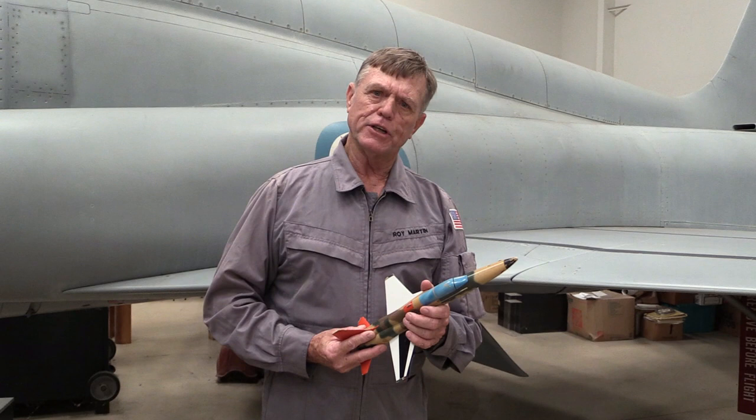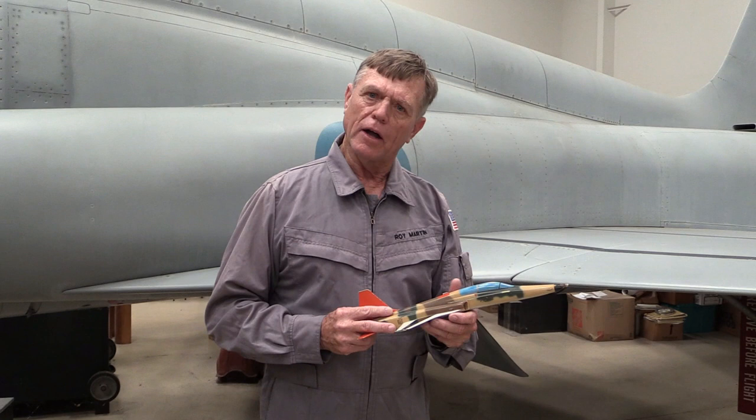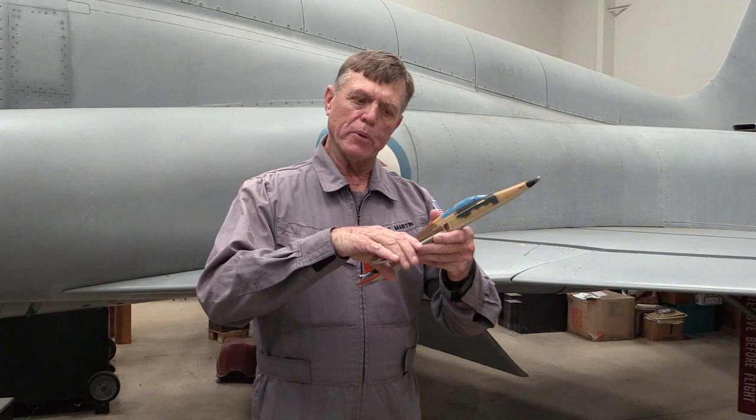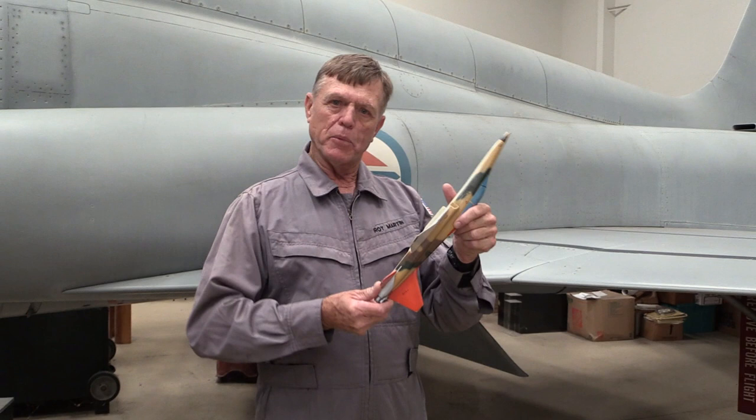Now, what was the fix? Well, the engineers went back and asked, what was the cause? The initial cause was the leading edge flaps being down. Why don't we bring those up? Let's reattach the airflow. Let's bring the lift distribution back so that aft stick will recover the airplane and bring it down through this region.